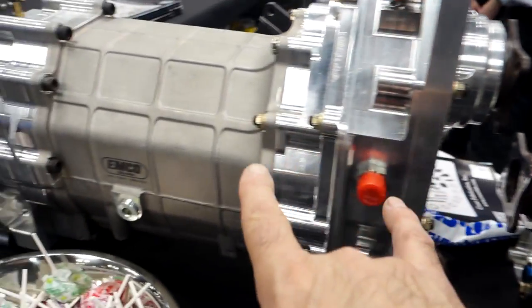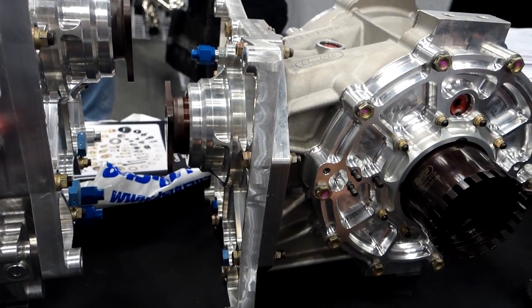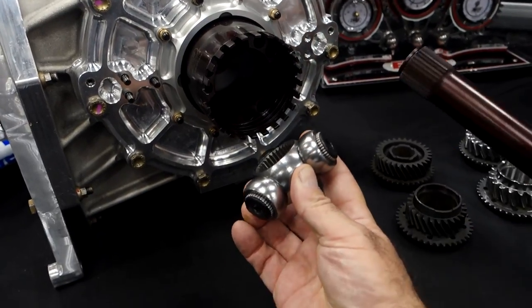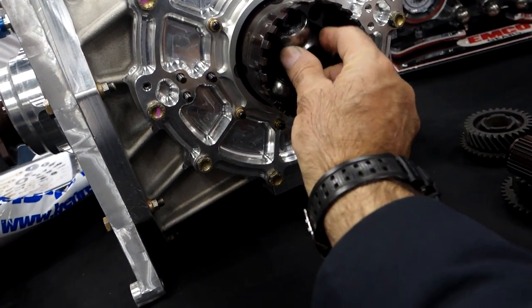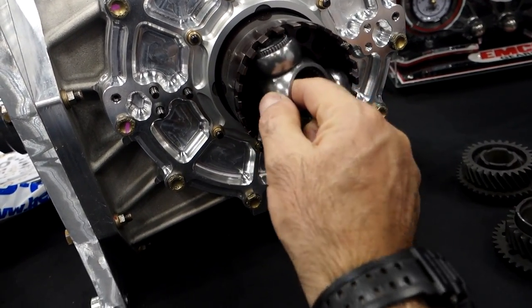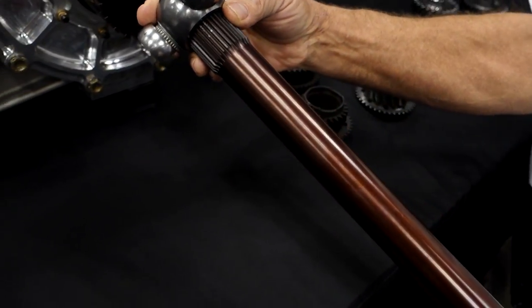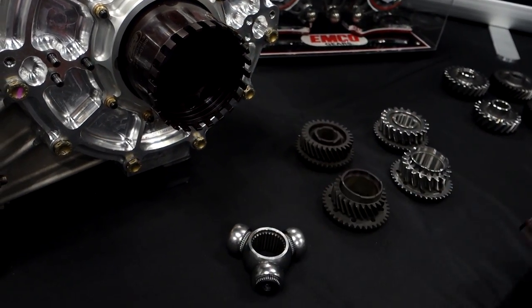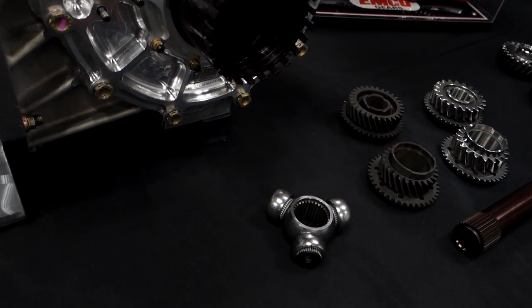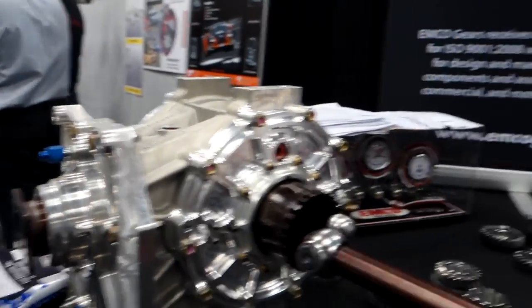It's amazing, huh? This is a transmission and a transaxle, and they're combined by a shaft in the middle of the car. So this is a tripod axle. Fits. Tripod, and there's an axle. That's crazy, you know. Wow. Yep. Look at that. And with this axle and that assembly, you can run up to 15 degrees. Wow, yeah. So it's basically like an independent rear almost. I wonder, do you think their brakes are inboard or outboard? On this assembly, the brakes were outboard. They're outboard? We have had some with the brakes inboard, yes. Right. I think so. It's a work of art. Thanks a lot, Tom. You're welcome.